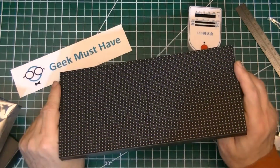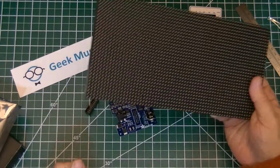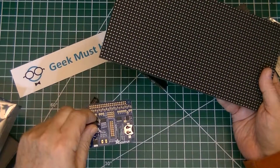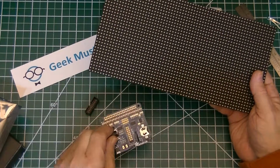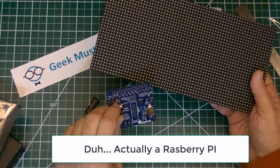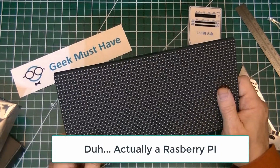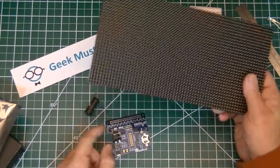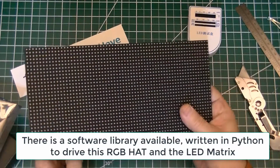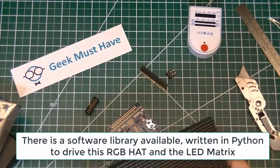We'll, in another video, be soldering this all up and testing it both on this panel, and I have even a larger panel. And this straps onto an Arduino card, I believe. Maybe a Raspberry Pi, I'm not really sure. I'll have to take a look. And with 5 volts in, it powers this board. So I have to make certain that there's plenty of current inside of the 5 volt power supply that's coming out to be able to power the card and all the LEDs on this board. Well, that was one of the items.